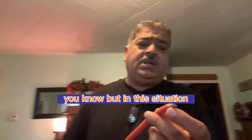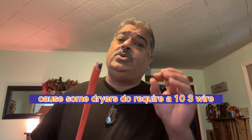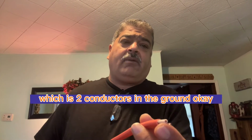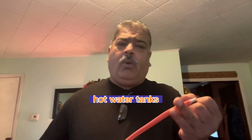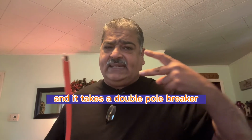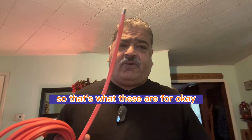But in this situation, these are used for 240 volts, mostly for some dryers, because some dryers do require a 10-3 wire, but some dryers will require 10-2 wire, which is 2 conductors and a ground. And the maximum rating for that is 30 amps, and it's usually for dryers, hot water tanks, things like that. Anything that's got 240 volts, and it takes a double pole breaker. Very rarely will you have a 30 amp single pole, but I'm just going to talk about the double pole. So that's what these are for.